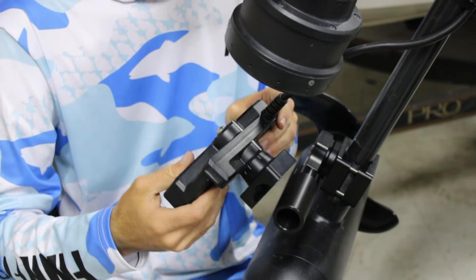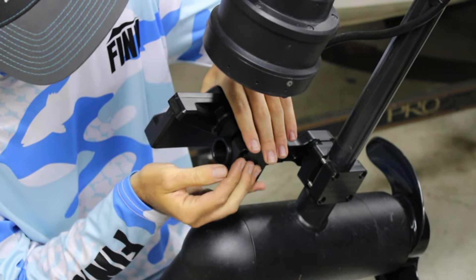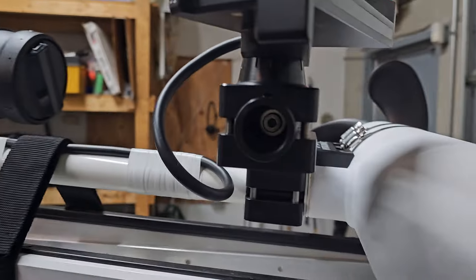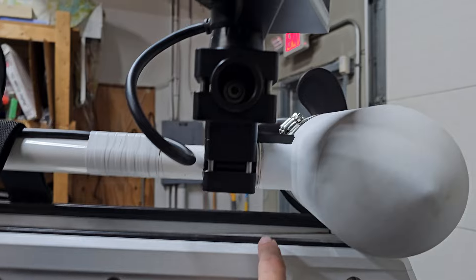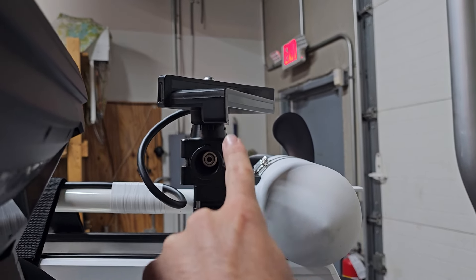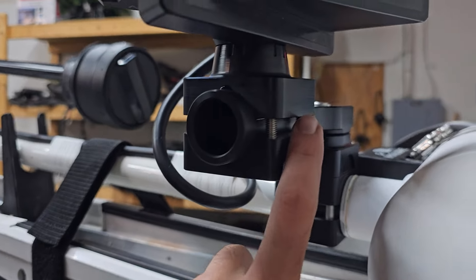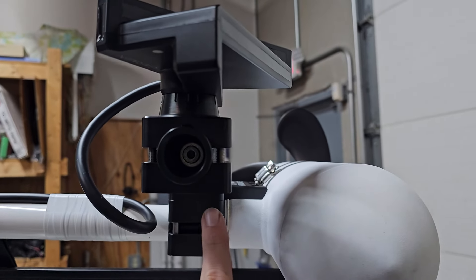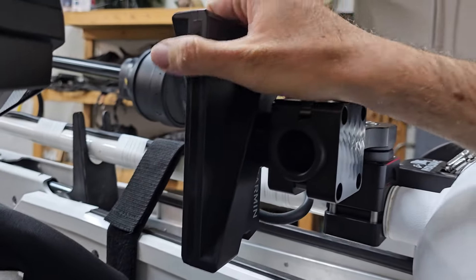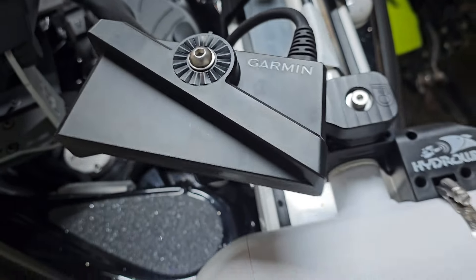The next thing is to put this assembly on the axle — similar to putting it on the trolling motor shaft, put both brackets on. Make sure you line this up: you want the transducer surface parallel with the flat lines on the axle assembly and the trolling motor shaft, giving you that zero degree angle everybody's after. Get them snug, then tighten these down. The notches on the backside of the Dominator axle make sure you're perfectly in line every time you go into perspective or back into forward.